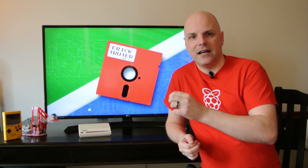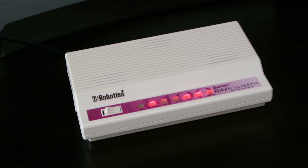Truth be told, I had to watch a YouTube video to double-check the actual boot sequence of an old US Robotics modem so I could get the LED lights coming on in the correct sequence. The final thing I added was transmit and receive LEDs — when you use the 3G router, it will flash the lights according to traffic being transmitted and received. Based on the volume of data, the intensity of the LED will increase or decrease. So the more data you send, the brighter and longer the LED will flash, and with less data it'll flicker very little or not at all.